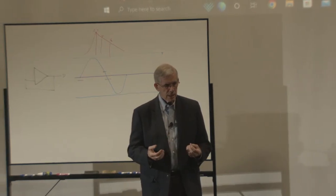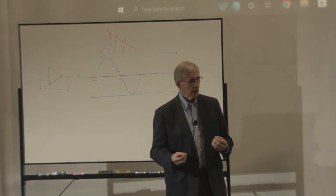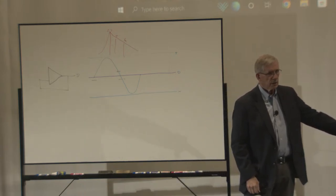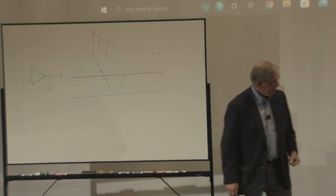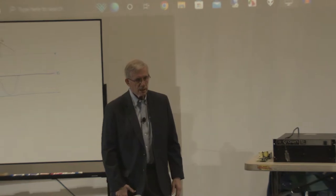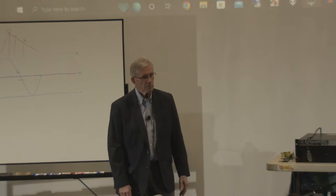The biggest thing is that there was nobody building parts for doing what they wanted to do. For example, in the power supply, nobody built transformers meant to run at 250 kilohertz instead of 60 hertz. Yet there were a lot of road groups who said, this amplifier weighs 60 pounds, and even though it may not sound as good, I'm going to use the lighter weight amplifiers anyway, because they took it down to 18 pounds or something for the same amount of power.